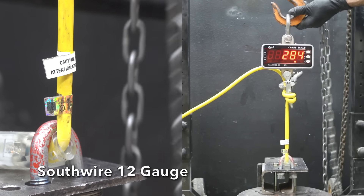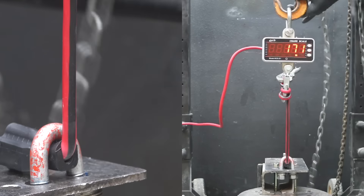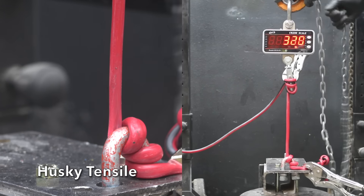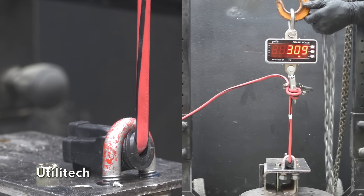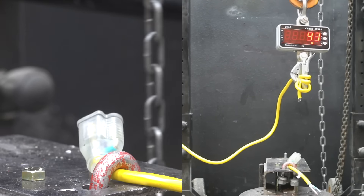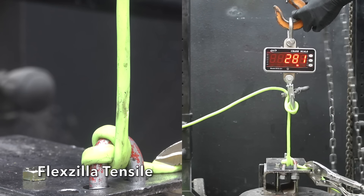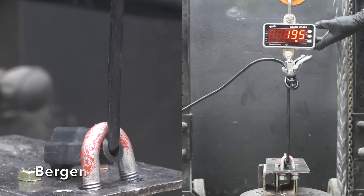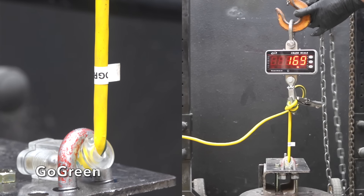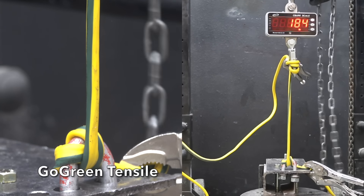The 12-gauge Southwire cord end held on longer than the 14-gauge at 288 pounds, with an impressive tensile strength of 393 pounds. The Husky moves into the lead at 346 pounds before the cord tore away, and the cord itself broke at 339 pounds. The Utilitech cord end outlasted the cord at 311 pounds, so the Husky holds the lead. The Snow Joe end also outlasted the cord, with 278 pounds of tensile strength. The Flexzilla made it to 257 pounds before the cord broke, with a tensile strength of 291 pounds. Bergen Industries gave up a little sooner at 201 pounds before the plug broke loose, but has a tensile strength of 319 pounds. Go Green seems made of a softer plastic and gave up at 169 pounds, with only 260 pounds of tensile strength.